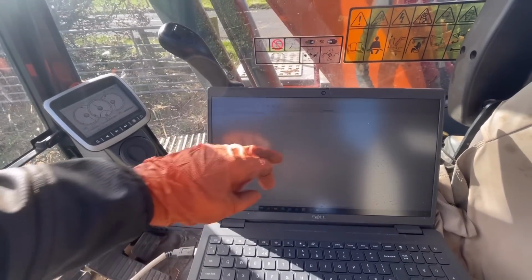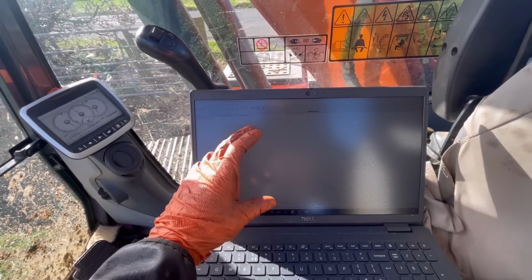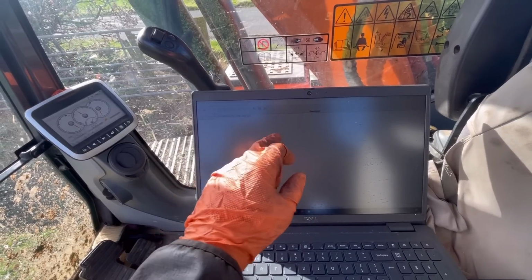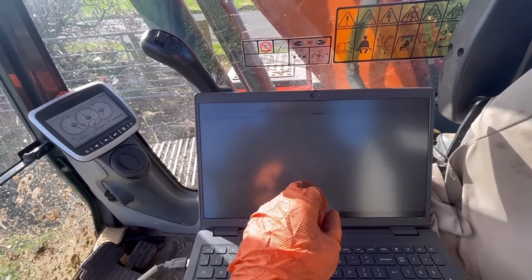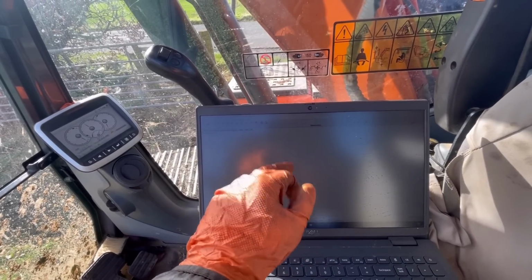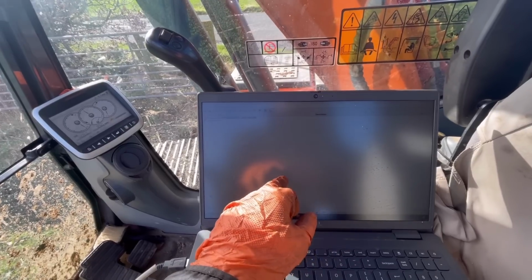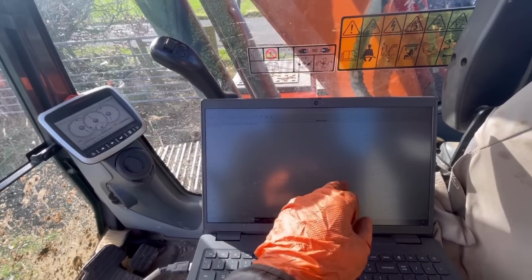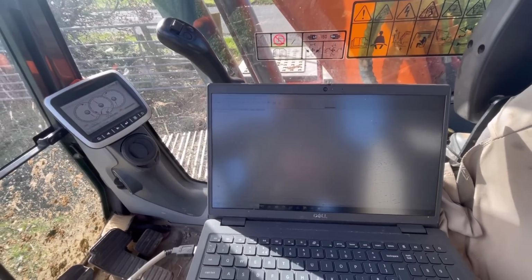So when you go to reset, it fetches up a box, and you basically then need to phone Perkins help desk and you ask for a factory password, and basically you need to read out all the numbers and figures in individual boxes, and then at their end they click OK, and that generates two unique factory passwords, which they then read out over the phone, and you input them and then input the second one and click OK, and that kind of resets the codes.